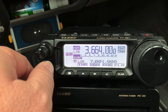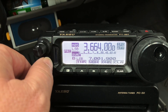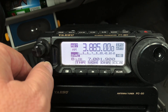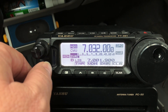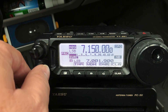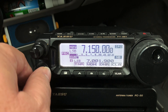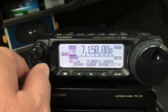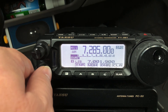Then I have some popular sideband frequencies — a good group of guys in there late at night in the southeast on that one, and a good group in the mornings on that one in the southeast. And then there's AM, 3885, a typical AM frequency. Memory 8 is 7.032, SOTA — summits on the air stations tend to go there. Narrow mode, IPO, may or may not do attenuation depending on the noise level. There's also a lower-end sideband frequency — notice IPO is on, and the noise blanker's on just because I'm in a truck and I do have ignition noise, so I saved that on. And there's South Cars, another sideband.